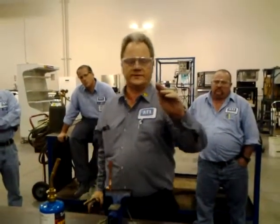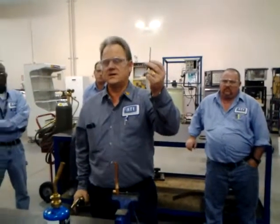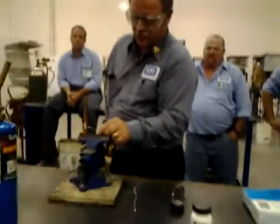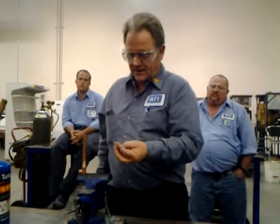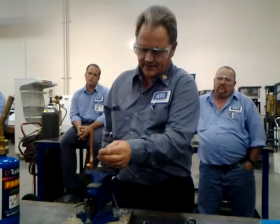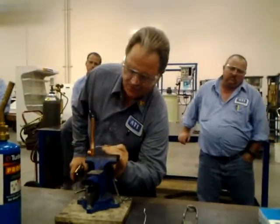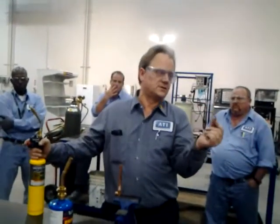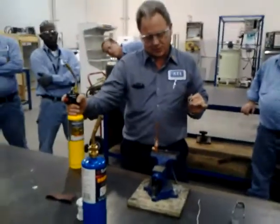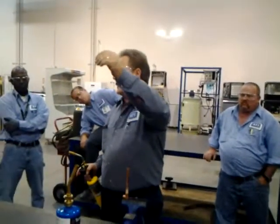What I want you to think of this thing is like a pencil point. The problem with this stuff is as soon as it gets slightly warm or it touches anything warm, it's going to stain it - leaving this silver colored stain on it. You don't want that. All you want is the solder right there on the joint. You want to build up kind of a beveled edge. This is kind of tricky. It takes a little practice. You've got to keep it right on the end with a steady hand, and it's very little heat. Once this stuff starts to heat up it gets real silvery - it almost looks like mercury - and it will start to melt. Once it gets silvery like that, some of it goes on. Kind of pull it away, let it cool down until it gets back to this cloudy opaque color. That means it's kind of set up.